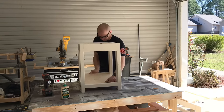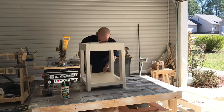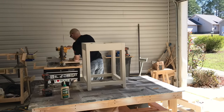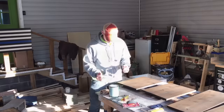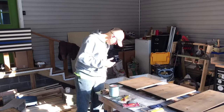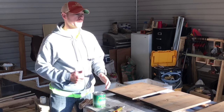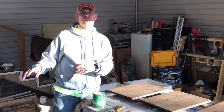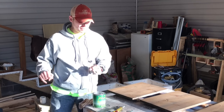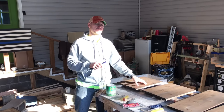I do a dry fit — you don't want it so tight you have to hammer it in, but you also don't want it so loose it falls through, so it takes a little nibbling with the saw until it fits perfectly. My stain has set overnight on these pieces. I've got one coat of clear on my tabletops and now I'm going to go ahead and put one coat on the shelves.